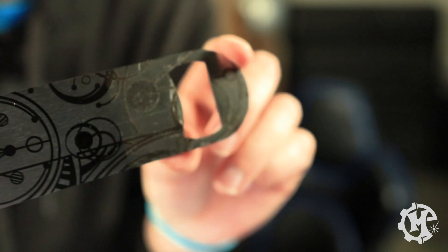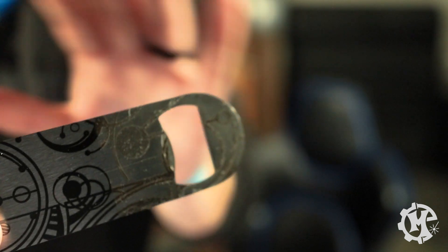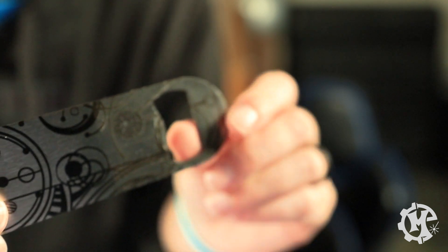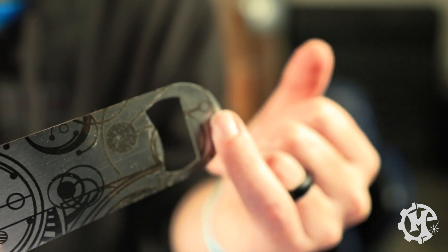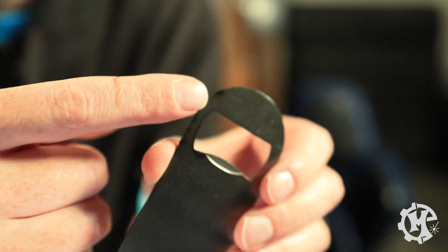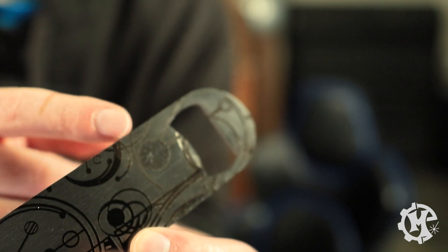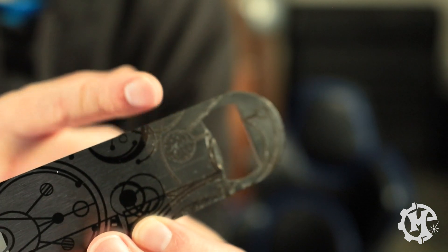The last one is the etch. I'll be honest — I'm not the biggest fan. If you try to clean it, you get a little bit of debris that collects in the metal and it's very hard to clean off. You get the depth, but it's also a lot dirtier. You can see it marked the back from ricocheting off the wood, and it marked the sides a little bit. It just doesn't give as good a result as I would like. I actually really prefer the annealing process over the etching process.